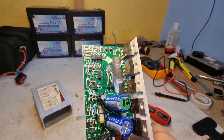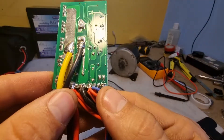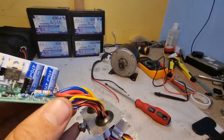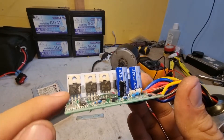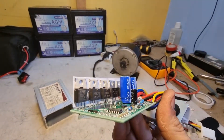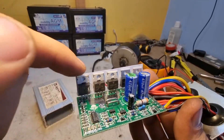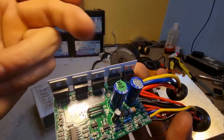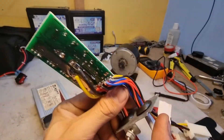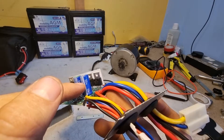I don't seem to see anything wrong; I don't see any burn patches. All the connections are all solid. The only thing I've noticed that's different is this one's got markings on it but the other ones are plain. So could it be one of the MOSFETs that's blown? This is the 5-MOSFET controller — it's a 36 volt but you can put up to 50 volt through it because of the capacitors.